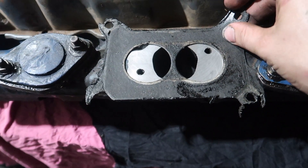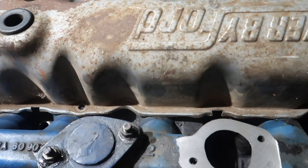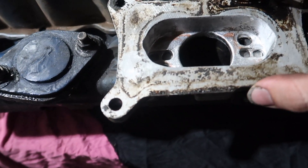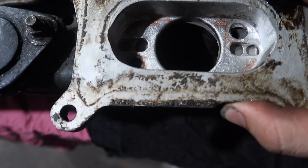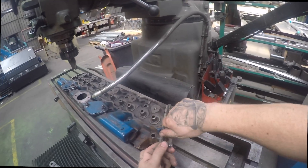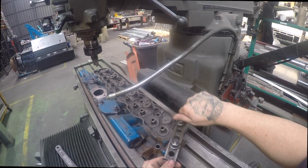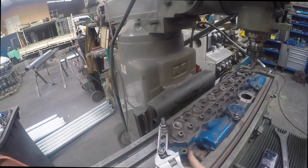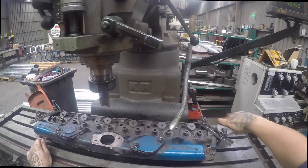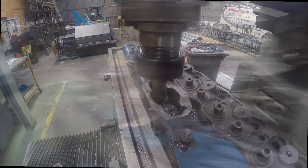Once that was machined flat we now have a flat surface to work out how large we can make the hole without protruding out the sides of the log manifold. The walls of the log manifold are a little smaller so you can't fully cut to the inside of the gasket, but it's still a lot bigger than before. I've created a template with the gasket and roughly machined it with a 19mm end mill - use the largest you can but this is what I had and it worked fine. One thing I learned with those wedges: don't do them up too tight - just enough so the workpiece doesn't move, as I did chip off a little bit of the head in a non-important spot.